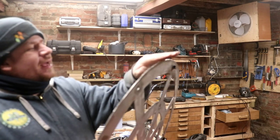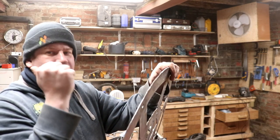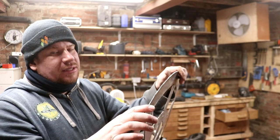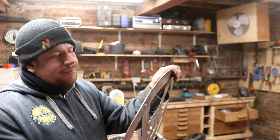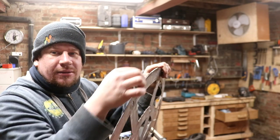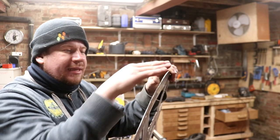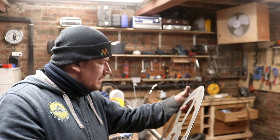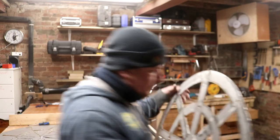And then on the edge, everywhere, I'll run around it with a pen when it's in situ. And everywhere where there's a big gap, because I haven't got any gasket or rubber that will fit round it, I will weld a bead with the TIG onto the edge to expand it, and then grind it back to the level it wants to be at. I think that'll work. Wish me luck.